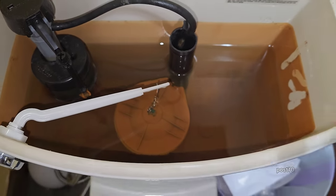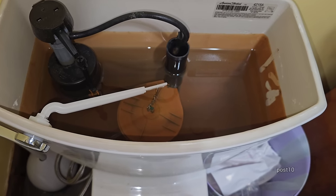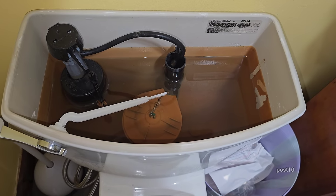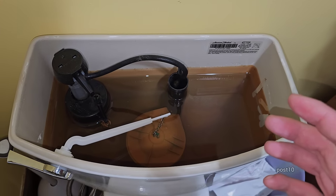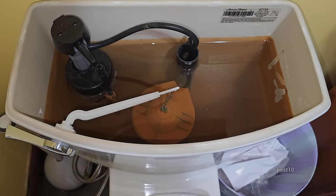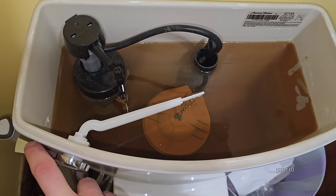So every now and then we have some discolored water if it rains really hard because we have a well, but that's only a couple days out of the year after big storms. So this stuff here is called iron bacteria. The well drilled into the ground outside about 200 feet has a metal outer wall. And if you're not home for a while, the water starts to come out very orange because this bacteria starts eating it. It's fine to eat. You can drink it. It won't hurt you at all. It just likes to eat iron. It'll eat metal parts. And it also does this stuff.